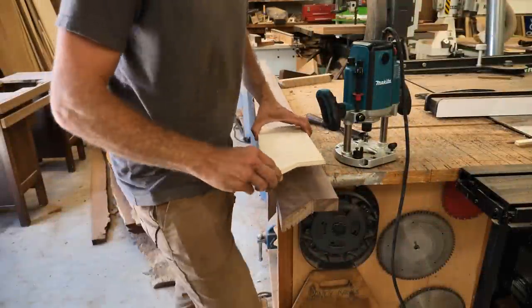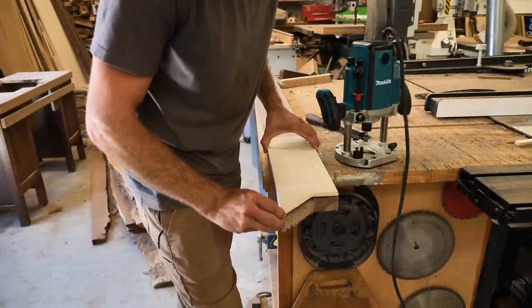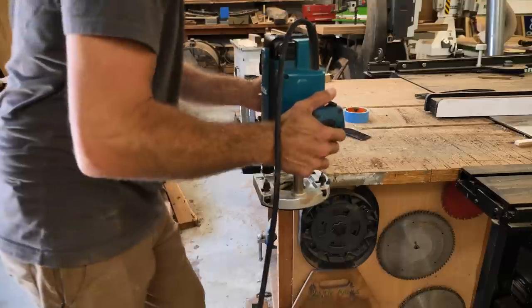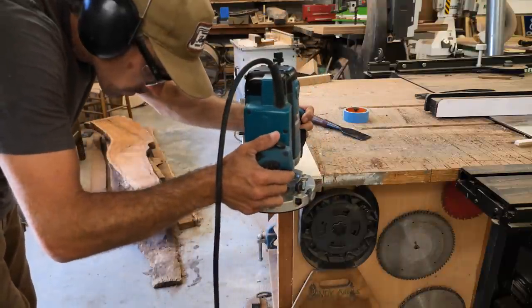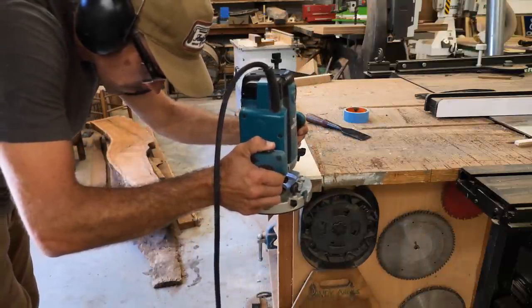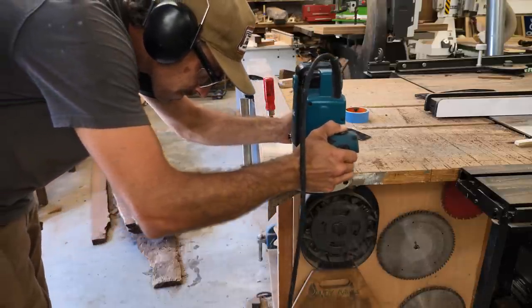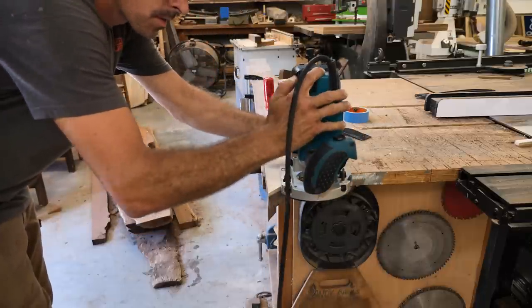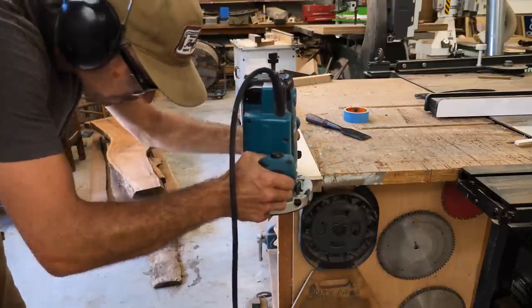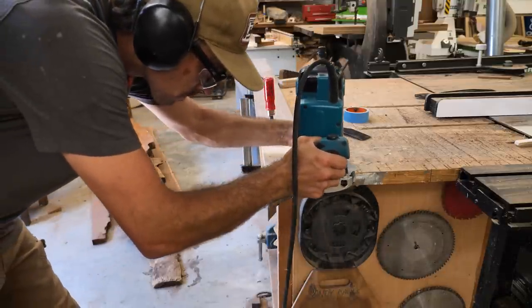This is kind of a hybrid miter joint here. The reason it looks like that is because this is the long back piece. It's 5 inches wide, I think, but the armrests are only about 3.5. So you got a narrow part coming into a long part. So I devised this kind of step, this kind of half miter. I start with just making a jig of the shape of the miter I need, make it on the CNC, and flush trim it with a router, use some double-sided tape and a clamp to hold it in place, and then we'll make the matching part to fit into that.